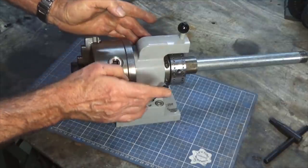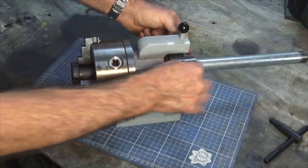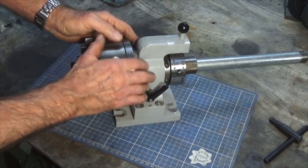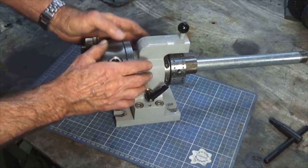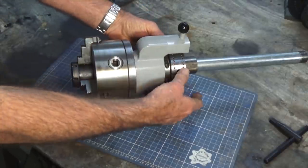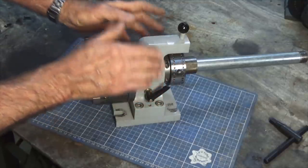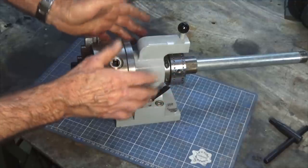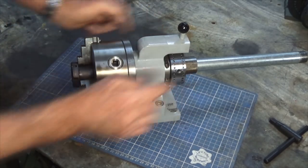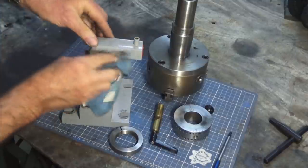The body of this is made of an aluminium casting, so is the base plate — that's a separate casting. It's got a 4140 spindle machined, and it runs directly in the bore of this aluminium casting here. You might say, well, that's bad, but it's not like we're rotating this at very high speed — it just has to be a close fit, and there's got to be some means of locking it. The division is done with this large collar on the end of the spindle, and it has a row of 40 holes and a row of 36. That allows you to do most of the common divisions you would need for most homemade parts. Let's have a look at the individual pieces that make up this assembly and then look at how the division is done. There are all the parts disassembled.